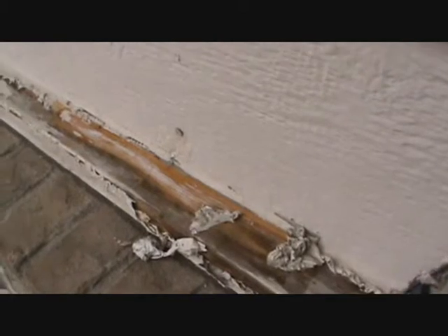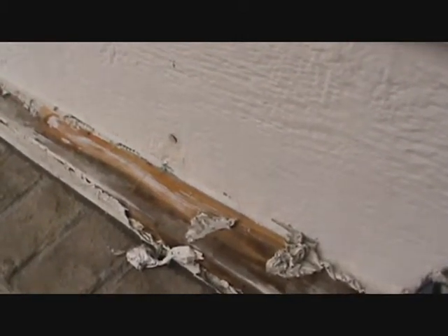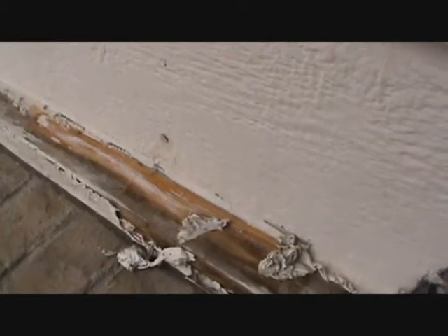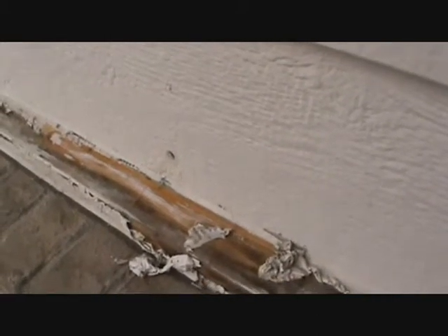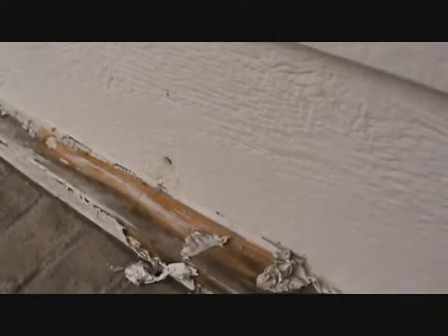We'll take just a little bit of light sanding, and then we'll put a special primer called XIM on it, which is very clear, it's very thin, and will saturate into that wood and almost turn it into plastic. We do this basically on any horizontal surface, because in Nebraska that's where snow sets.